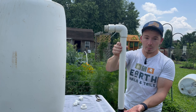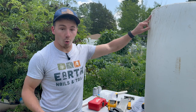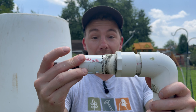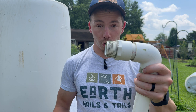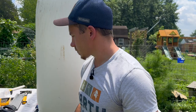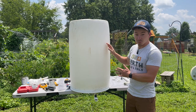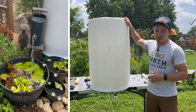I'm going to be using my hole saw to cut out the hole in my rain barrel. Whenever you're using your hole saw, make sure it is the same size as the threads — it can't be too big, otherwise the threads aren't going to lock on. So get your threaded connection piece — this is one and a quarter inch PVC and this is a one and a half inch hole saw, and you can see how that lines up perfectly. If I wanted to use three-quarter inch PVC, I have a one-inch hole saw that fits perfectly for my three-quarter.